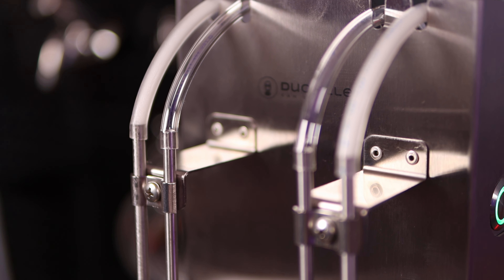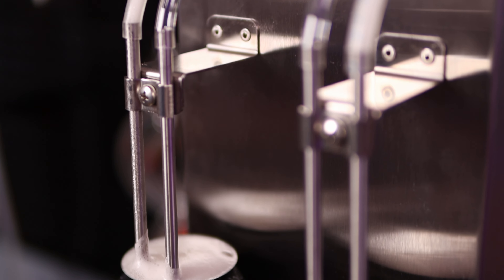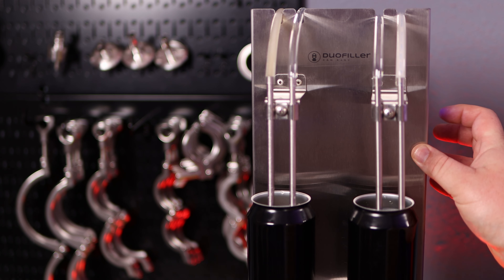Keep in mind, when you're canning you're going to want to alternate from the left or right side. If you let it sit too long, you will have a little extra foam that comes through, so just alternate left or right. Typically when I first start, I'll start one, give it a good 10-20 count, and then start the other one. Then it's just going like clockwork — set one, push the button, start filling, then go to the next one and cycle through them that way.